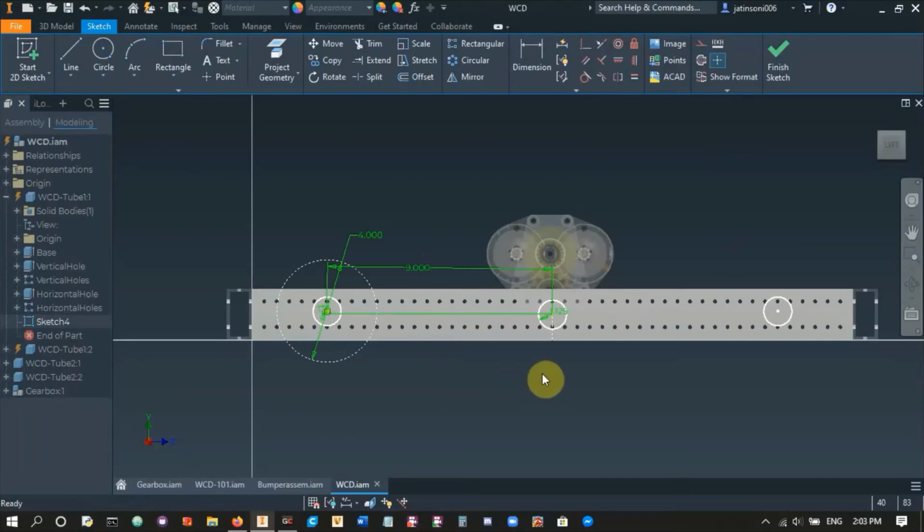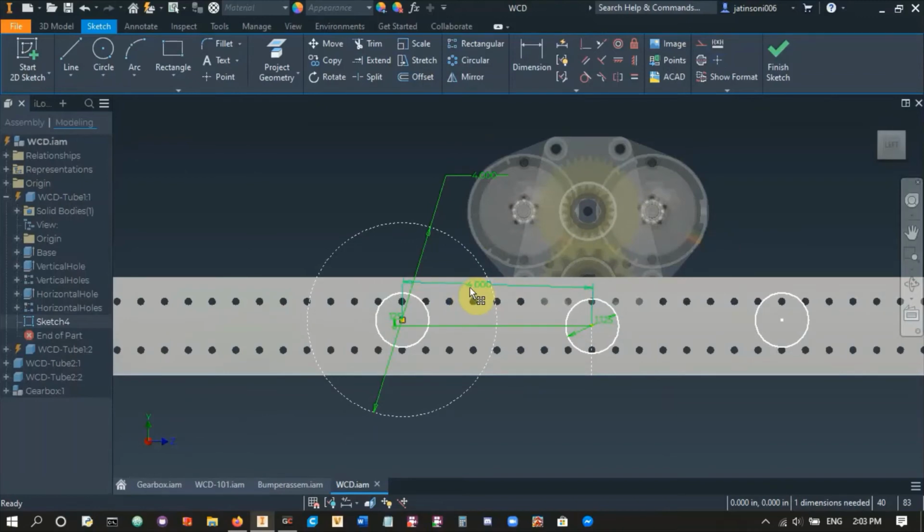And basically, if your wheels are further apart, it gives you a more stable base, right? Think of a limousine. It's really long, so it's very stable, but it's also really hard to turn, because your wheels are so far apart, your robot takes forever to turn. If you have these wheels closer together, like instead of 9 inches, they're 4 inches apart, you can turn very well, but it's also very unstable, and so it's going to be a little bit more tippy.